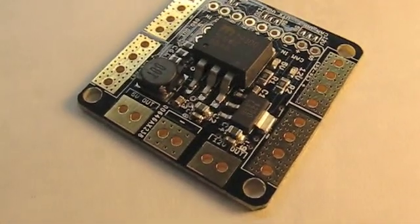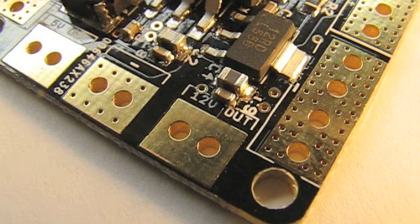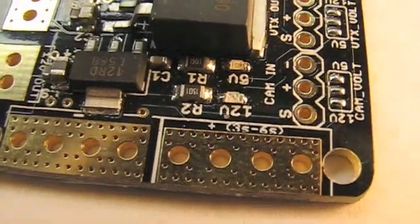The ATAS board also has provisions for 12 volt and 5 volt power output. The 12 volt can be used for things like LED lights, and the 5 volt out can be used for extra servos. The negative pad in the center is where your negative wire solders up, and then the positive side goes to the 12 or 5 volt side.